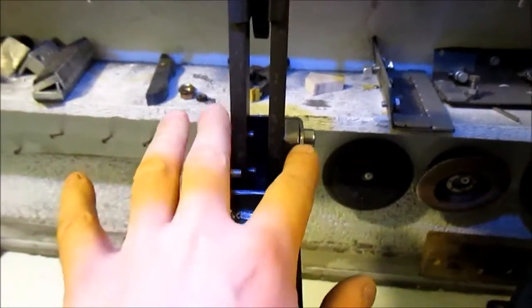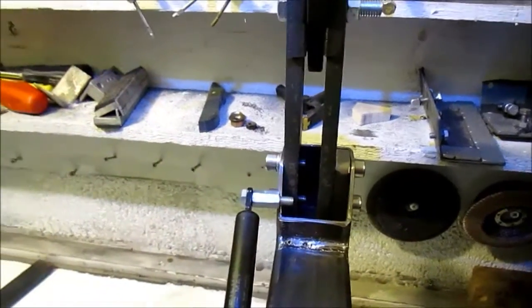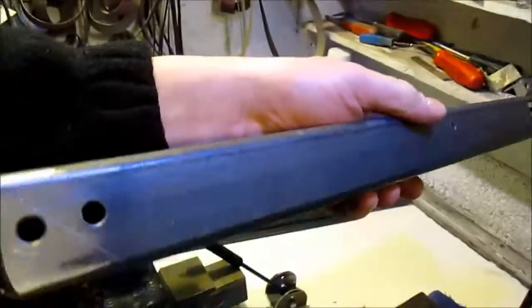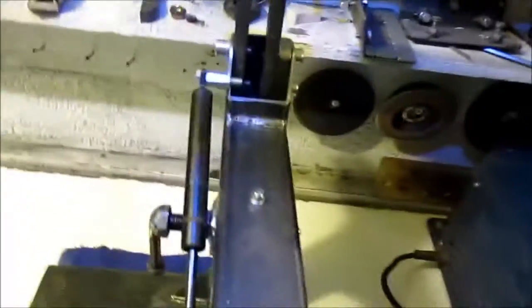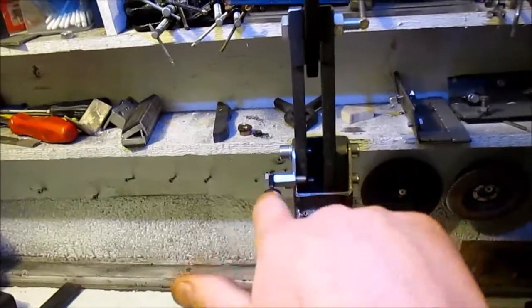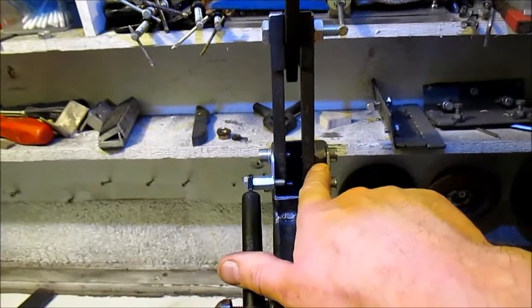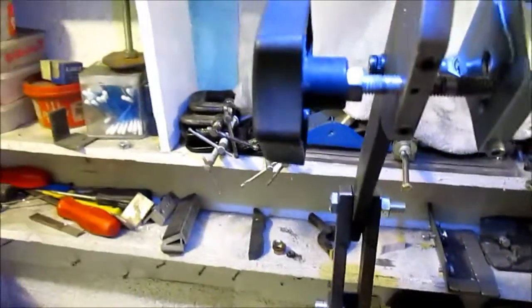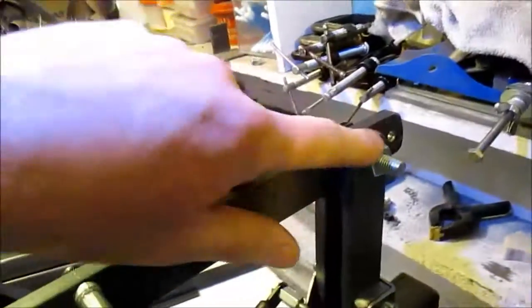I redesigned this. This was 2" box up to about here, I think, with just, it's actually this piece pivoted out of it, the shock went in the middle of that. I hadn't done any of the tracking adjustment at the time, but I wanted some more adjustments to be able to move this way or that way. So I can move this. That's a piece of 10mm in there, so put a 5mm either side or whatever, just to get the spacing good. Some more Kydex there as washers, and just a 10mm bolt.